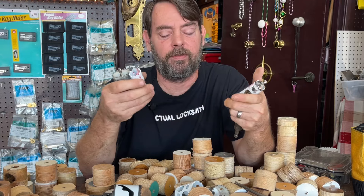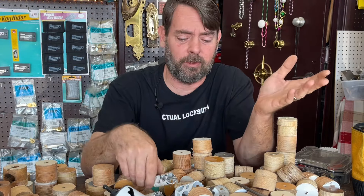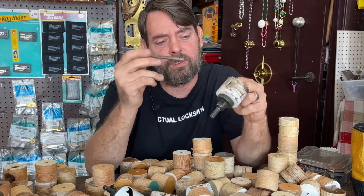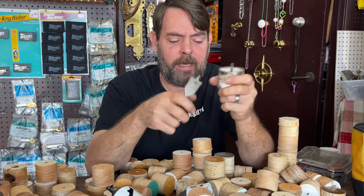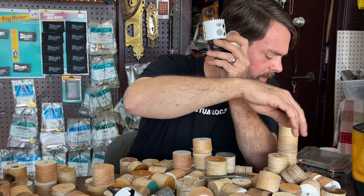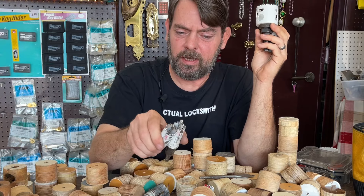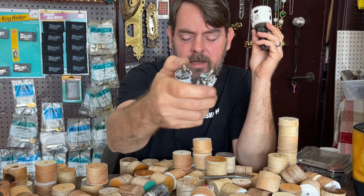When you're working on metal doors you have to be extraordinarily careful. I may have just been going too fast — any number of things could have happened, the drill bit could have had a weakened part. So I said let's go ahead and get the two and one-eighth inch Drill Hog bit and their mandrel and pilot bit just to give it a try. Looking at the tooth pattern on a new Milwaukee — they've also gone to carbide teeth, really pushing on that. Milwaukee bits have a coarser and deeper tooth pattern, so we have two different tooth patterns to compare.